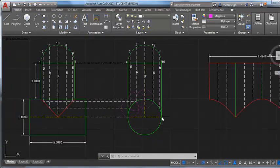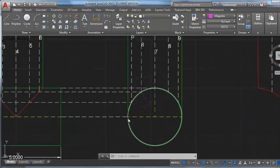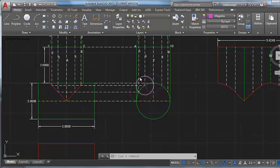So I need to lay that out on my pattern. It takes up half my pattern, which would make sense to me too. That branch and the hole cut forward is going to take up half of the circumference of the header. Anyway, one of those patterns picks up this. That's why I've made them all the same color. You'll see as I do other developments, I'll change those colors when those spacings change.